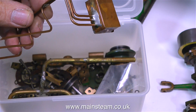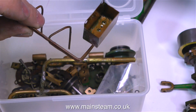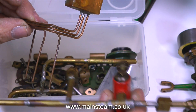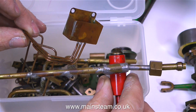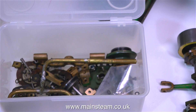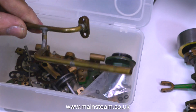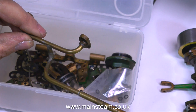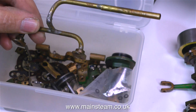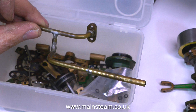There's also a very nice oil reservoir and pipes that feed the main bearings. Apart from being very useful as a lubricator, things like this on model engines just make them look better — unlike the inlet manifold. The inlet manifold is not a thing of beauty. The displacement lubricator is fine though, that's a commercial item. This is the exhaust manifold, from the same school of soldering as the inlet manifold. This really spoils the engine. These are not serviceable items and will go in the bin. They're quite easy to make correctly, so I don't see why someone's gone to the trouble of making them so badly.